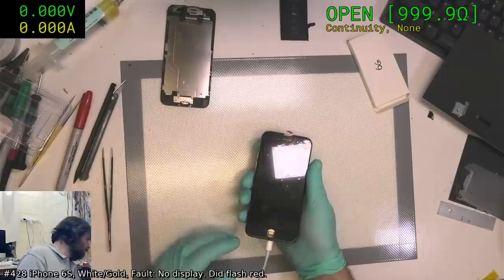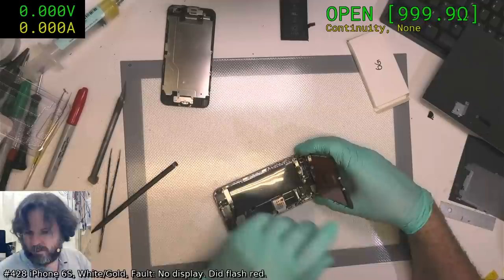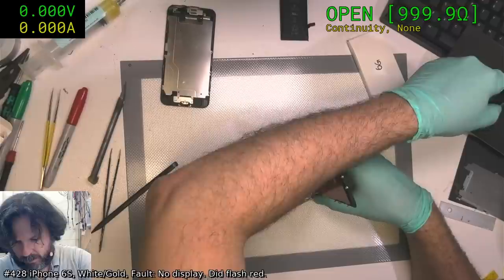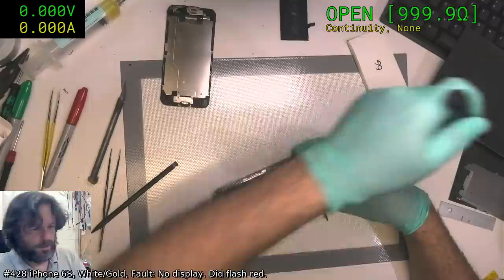So I wonder if we've got a blooming backlight or something. We'll put the Taptic back in. And that way, when we think it has booted up, we can just flick the mute switch back and forth, and that will let us know if it is alive. At least a very primitive way of knowing. It's kind of like having a debug LED on your circuits.